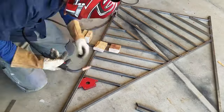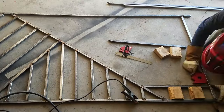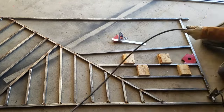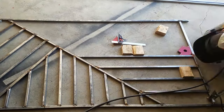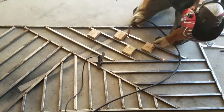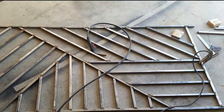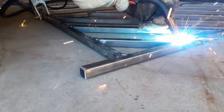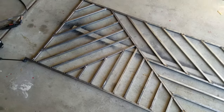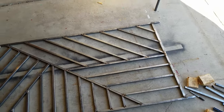Only in my wildest dreams would I have a welding table that big, so yes it is laid out on my garage cement floor, which is flat enough. You can't tell that big of a difference, but one of the key things which is critical is to get the spacing of each of those perfectly, and that is done just with some simple wooden blocks. You wouldn't think with all of the crazy angles that it would make that big of a difference, but it will stare at you crooked like an unleveled picture frame.